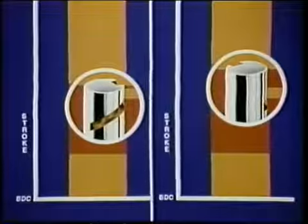When do you want the shorter effective stroke and less delivery? Yes, at low idle. You want the plunger helix turned this way, so the helix will spill sooner for a shorter effective stroke. And turn the other way for starting. The plunger lifts more. The helix spills later, so a longer effective stroke.